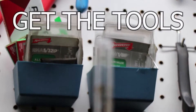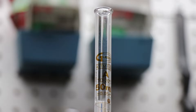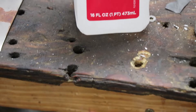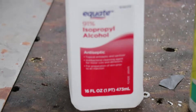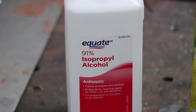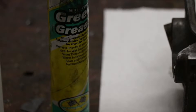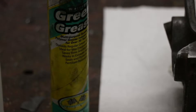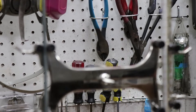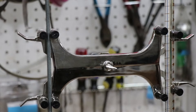The first step is to get the right tools for the job. This is a Class A bubble burette and I have a link in the description for that. Then what goes in the burette is isopropyl alcohol, which won't damage or rust your cylinder head if there's any steel in it. Then you use some grease to seal this next piece to your cylinder head. This next piece right here is a small piece of Plexiglas or Lexan and you just drill a small hole in it. Then the last piece is a bubble burette holder so you can accurately measure your cylinder head volume.